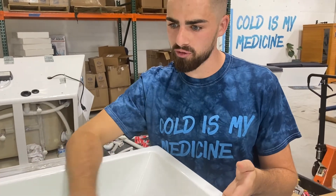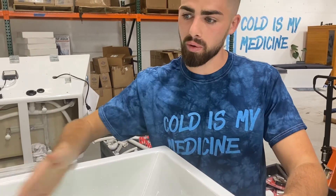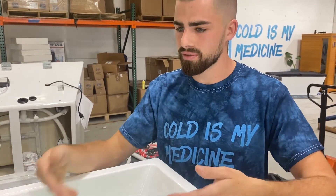All right, if we have full flow, then we're good to go. We want to let the unit run for a couple of hours at that point and make sure that the water is chilling. If we do not have full flow, then we might have ice in our chiller. We want to turn everything off for 48 hours. At that point, turn everything back on and if we still have any issues, just reach out to us.